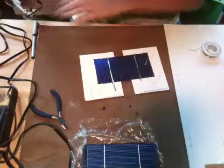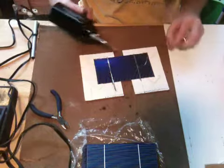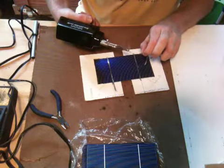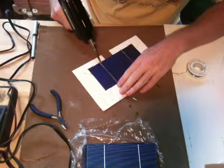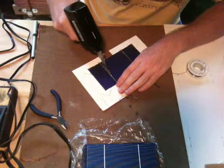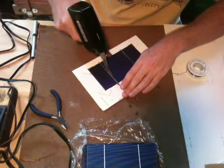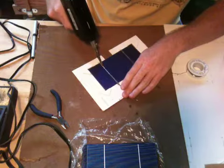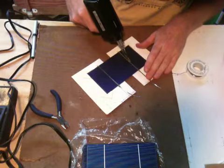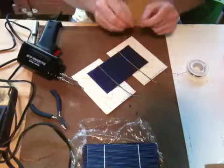I've been getting rid of my soldering iron because it's only 40 watts and it seems to be a pain. These things seem to absorb a lot of heat, so I've been switching to a 100-watt crappy soldering gun. I have a feeling if you bought a decent soldering iron this wouldn't be an issue, but since I'm trying to do this as cheap as I can, I'm just making do with what I have. I added a little solder to the tip of the gun — it seems like it helps with heat transfer, because basically what I'm doing is heating the tabbing wire which in turn heats that strip of solder I laid down on the cell. This seems to improve the chances of it adhering, because otherwise you're just making contact with whatever metal is there.